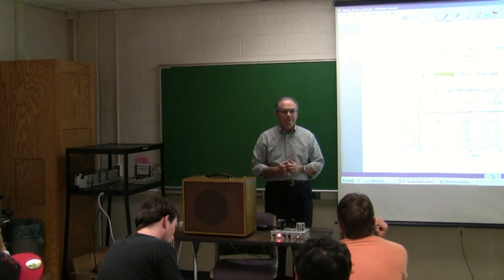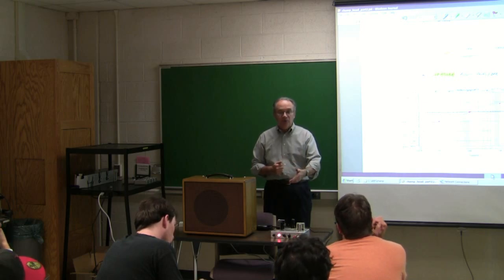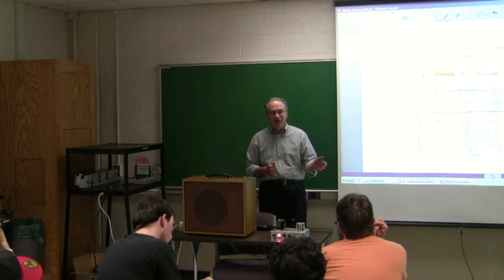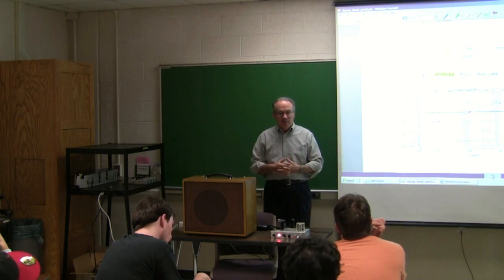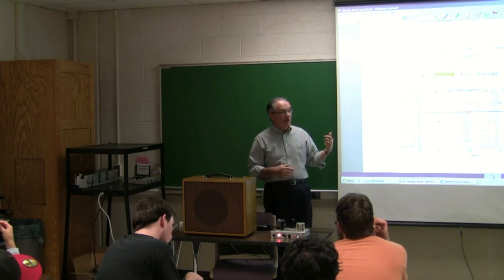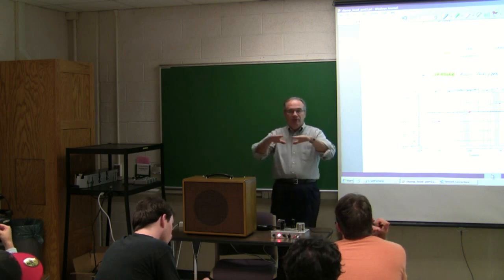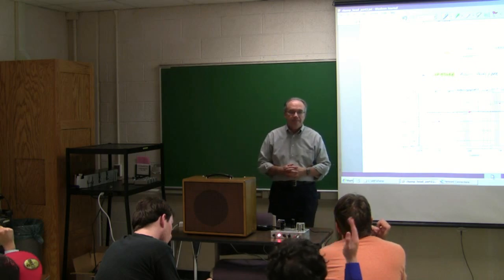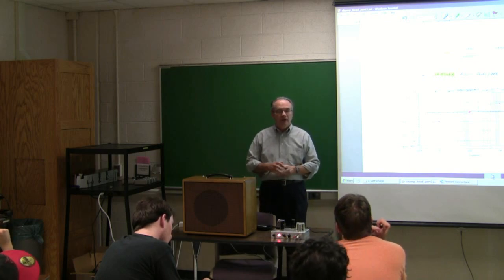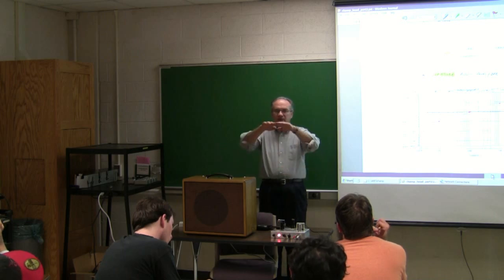Is anyone bypassing that circuit? Who's building these? Not really, although the original tone control didn't do anything, so it was like it was bypassed. So it's just a straight amplifier, so we're just giving you the audio band. But actually, that one curve where it's flat, the one that's before this one, the first one, that's really the full amplifier's bandwidth, as if the tone control weren't there. If it was like exactly in the middle. Yeah, right. And you turn the volume almost all the way up. You kind of short out one of those capacitors, and you pretty much get a flat response on it.